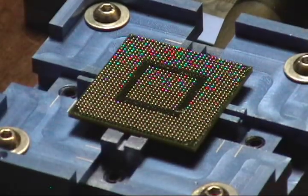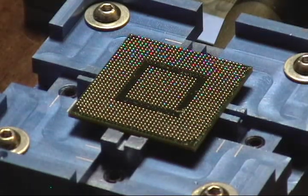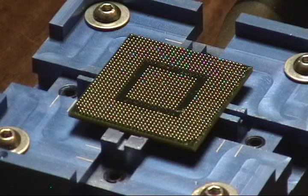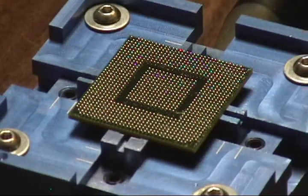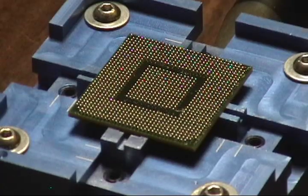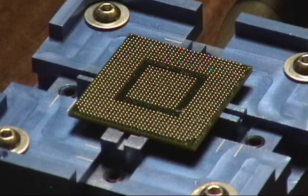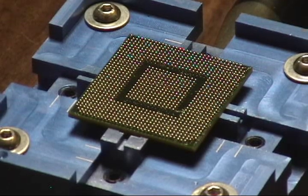Just have a glance over it. Make sure you don't see any that are showing more than half the pad. If you don't, you can try it. Grab your hot air gun without any reducing nozzles — just the hot air gun. Turn it on. Since this is a bigger chip, you're probably going to need to move it around sooner, but very slowly. Put mine on about one and a half to start off. Temperature 365.